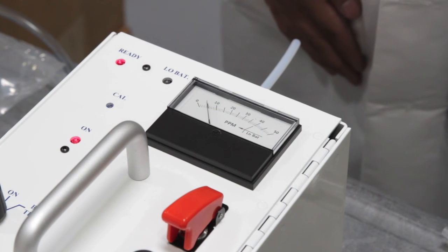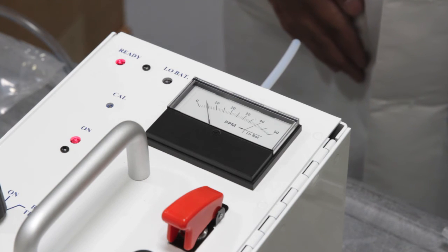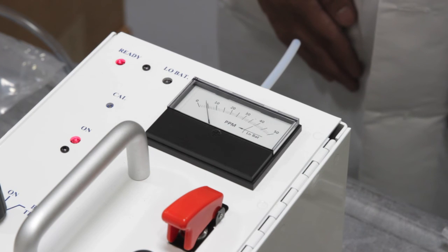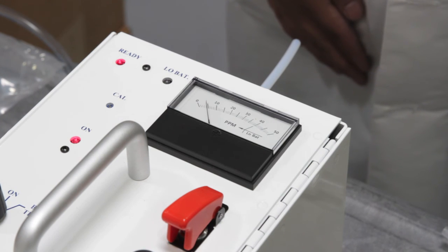It is not necessary to wait for the meter to reach zero before connecting the sample gas for the second and third time. The readings should be within plus or minus 2 divisions of the average of your 3 readings. Readings can sometimes jump when the sample bag is disconnected and then dropped out. This is a normal condition which occurs due to changes in pressure.